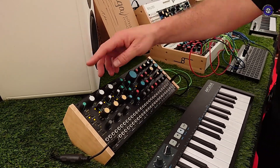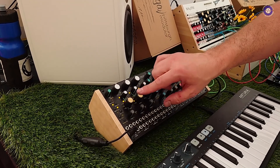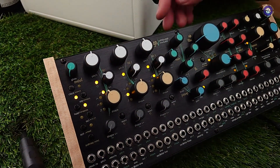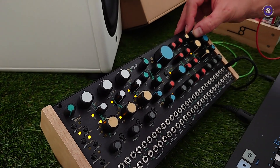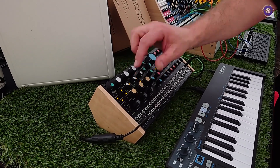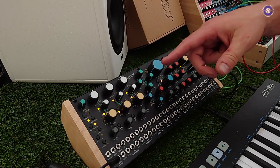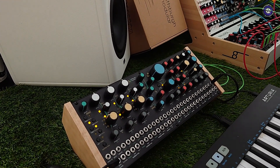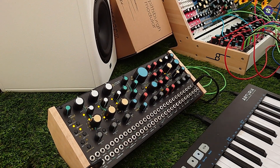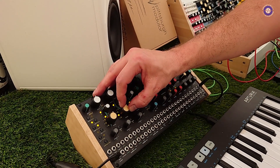What Tyga is, is a three oscillator monosynth. Its specialty is that each oscillator has a dedicated wave folder. You also have additional wave shapers in there that give you really unique waveforms and sounds. We call the initial wave shapes 'seeds,' because you never see them coming out directly. On an oscilloscope, you would never see something that looks like a sine or triangle wave — we've shaped it internally enough that they look a little different, but sound like you'd expect. That's the magic, because it allows our wave folder to hit it in really interesting ways and get sounds you maybe haven't heard anywhere else.